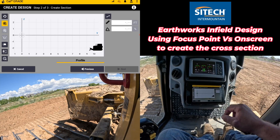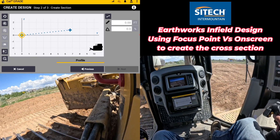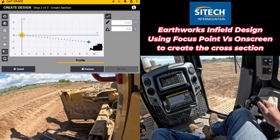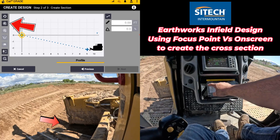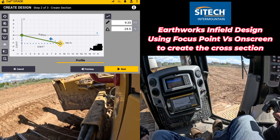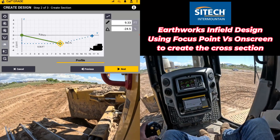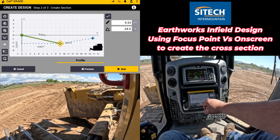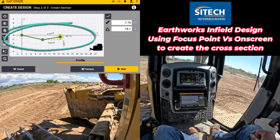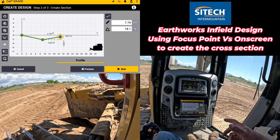What I'm going to do is set my blade up on the left side at the very top of the slope — we'll set right there and hit the plus button to record a point. Then, straight across from where that same point is, let's go ahead and set our blade tip down on the bottom right there, relatively straight across from the other one. We'll set down in the corner there, hit the plus, and then do the same thing one more time, as straight across as we can get it. We'll set up right at the top there and hit plus. Now what I've created is my own cross-section based on what's actually out there, so I've actually matched it for sure.